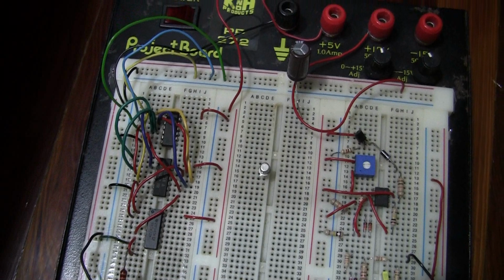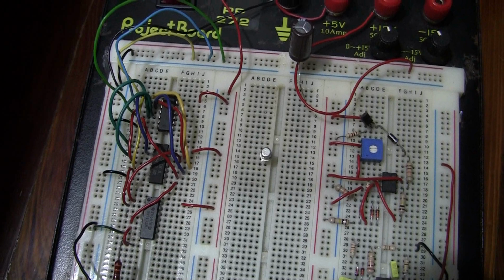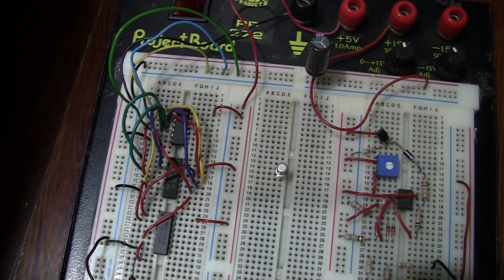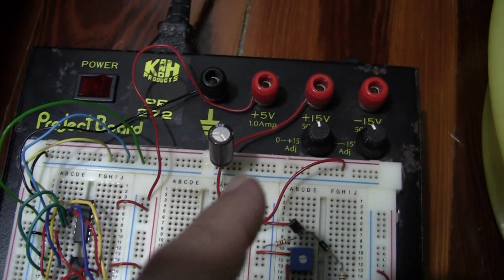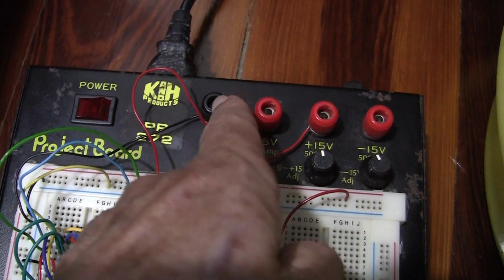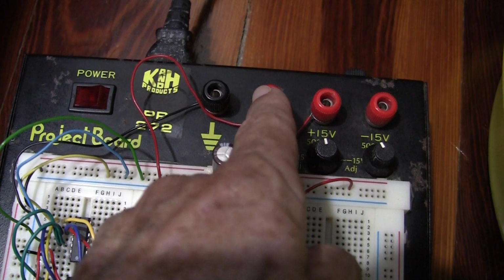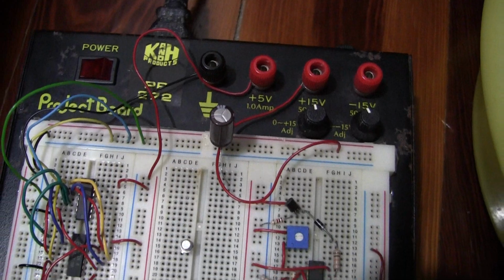Things to check if your circuit does not work correctly the first time. If you get no light at all on any combinations of the A, B, and C, then the circuit may not be getting power. Make sure that you have wrapped onto the metal when tightening down the nuts at the top. It is easy for students to snag the insulation instead of the actual wire, so you should be screwing down on the actual wire and not on the insulation.